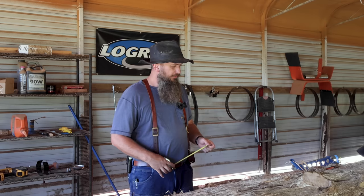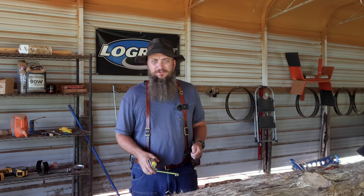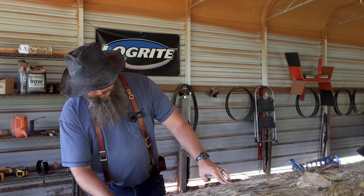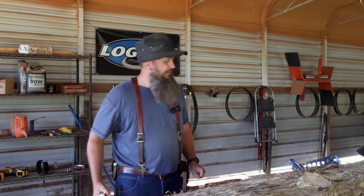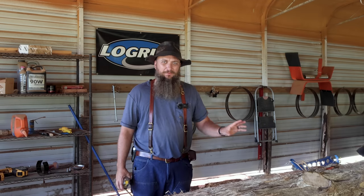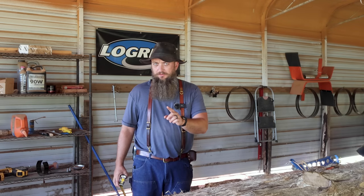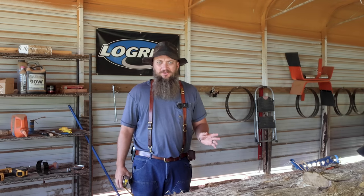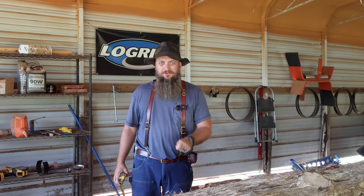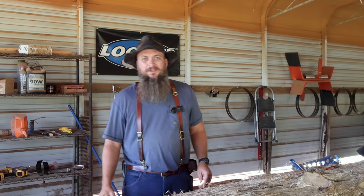We're going to be sawing these into 1x6s. My dad called me. He needs about 16 of these to finish up a fence he's been working on. These are pretty small, though. The diameter on the operator's side is barely 12 inches, about 10 inches down there, so there's a little bit of taper in this, but this is the ideal size cedar, or juniper, that you can sawmill, guys. You get these cedars that get 20 inches and bigger, and they have very, very large voids in the middle of them. This one actually has a void right there on the top, but it shouldn't be too bad.